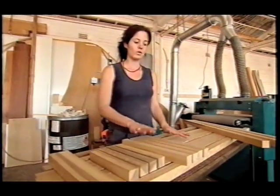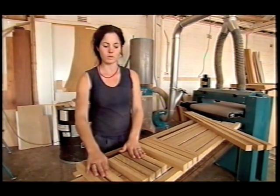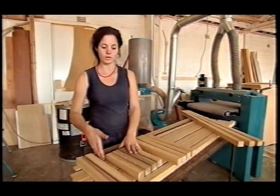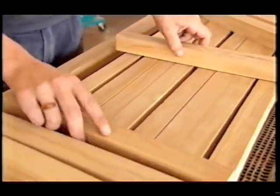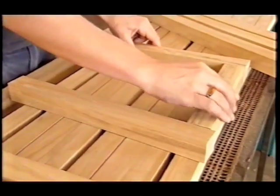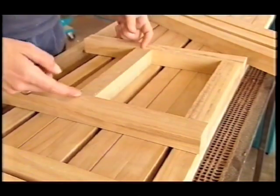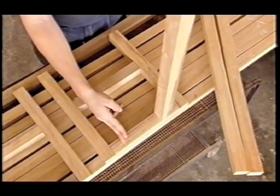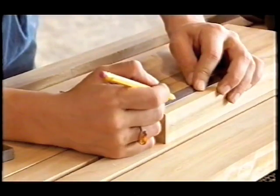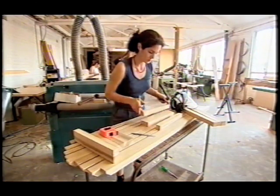I've docked all the pieces to length. So we've got four legs, four short cross members, two pieces which will be used with cross halving joints through to support the top, and three long pieces. So effectively I'll be making two leg sections with mortise and tenon joints, and then I've got the three long sections which are going to support the top. The type of joint that Laura uses to put the main frame of the bench together is the mortise and tenon.